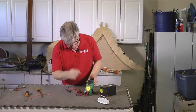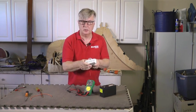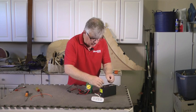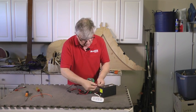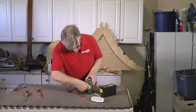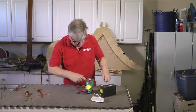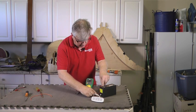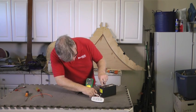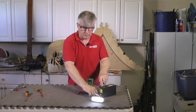The last test we're going to do is for amperage. I've got an LED masthead lamp here and I want to know how much current this is going to use, or how much drain it's going to put on my battery. I'm going to temporarily connect the black to the black on the battery — if I touch this you'll see it come on, so we know it's working. Then we switch over to amps, plug that in, and connect the red probe to the battery and the black to the other side. The light lamps, meaning power is going through the meter. We can't use more than 10 amps with this meter, and you'll see it says 0.81 — so it's less than one amp. We're using 800 milliamps of power to run this LED light.